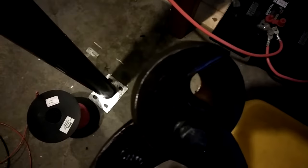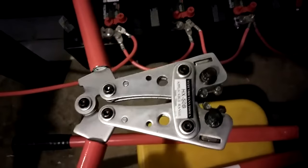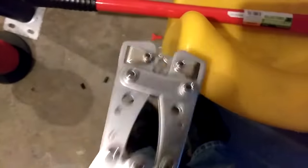If you're getting wire cutters, I have to suggest this: you want the rounded cutters, because if you get the flat ones, that flattens the wire and you're not going to get your lugs on there to make your own cables. So just recently I've been in the mode of making cables, and you get all the stuff at your local hardware store. This crimper is from eBay — I don't remember the price — but it's very efficient, I love it.